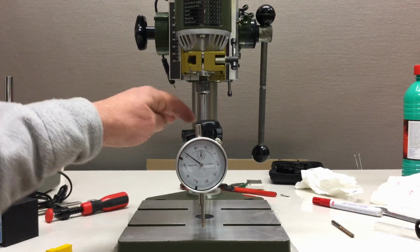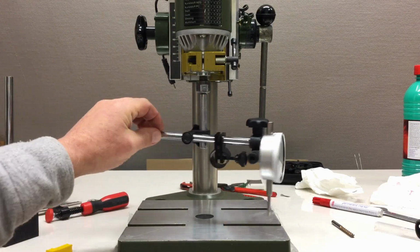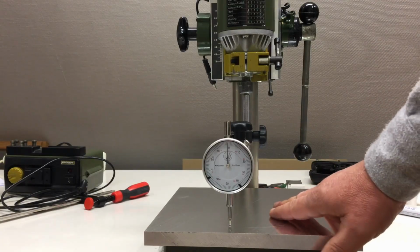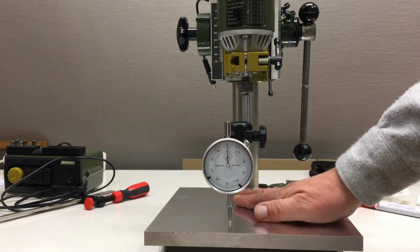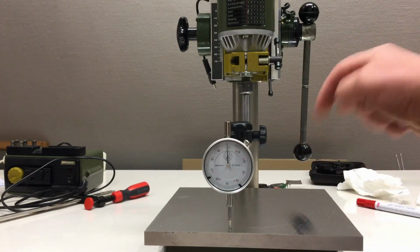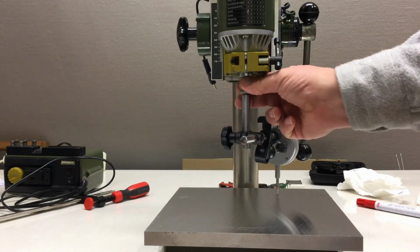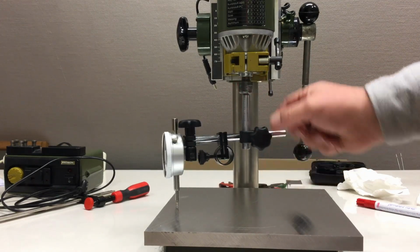I attach the dial gauge now to the shaft so we can rotate it freely around the table. There's only one component missing now for the tramming, and that is some kind of a precision plate. This is a precision milled aluminum plate. It was featured in a mailbag card here, link in the description. So we can freely rotate that without getting hung up on all the nooks and holes in the table itself.